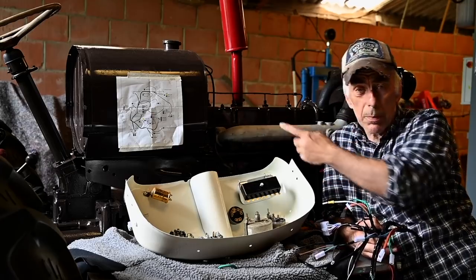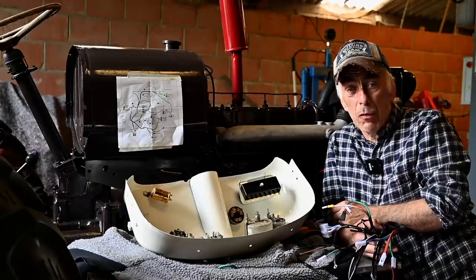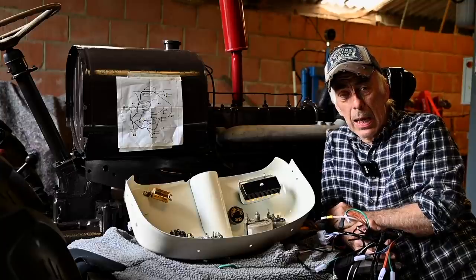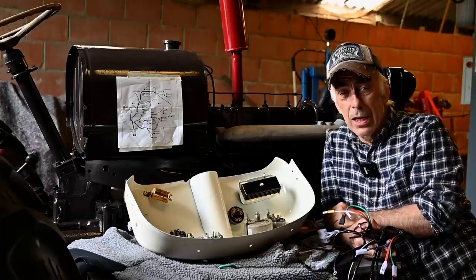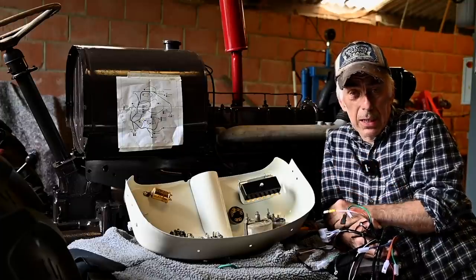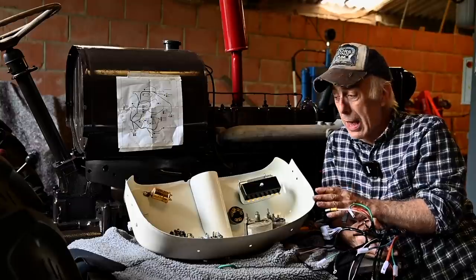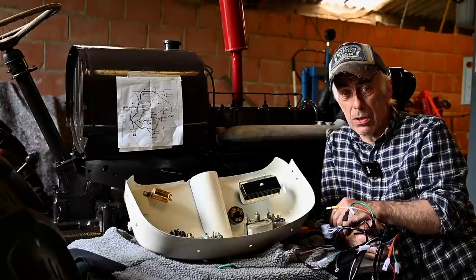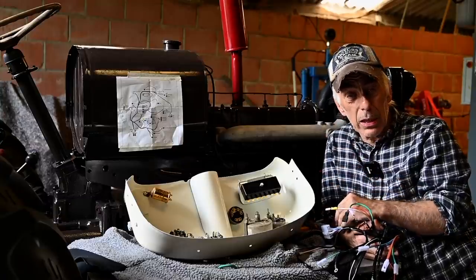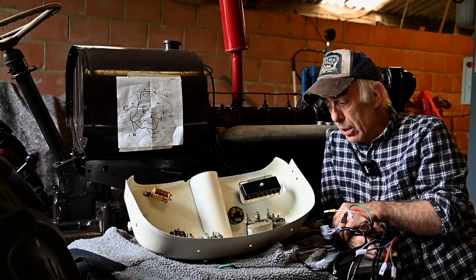Every so often I'll give you a close-up on the diagram. It depends on what type of wiring loom you have — just follow the color code. I'm going to allow the lights and blinkers to work even without the contact being turned on — that's a choice you make. Interestingly, there are almost no relays on this tractor or on the original David Brown circuit diagrams. Everything is really hot switched. With no further ado, let's start with the first circuit.